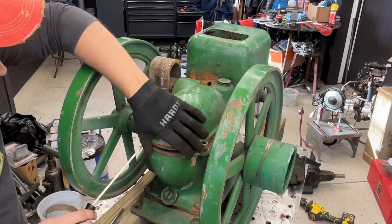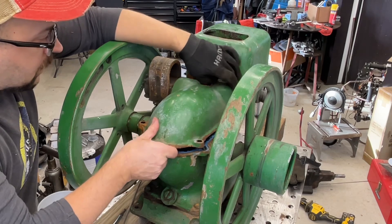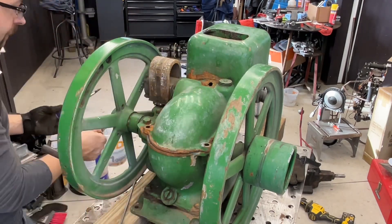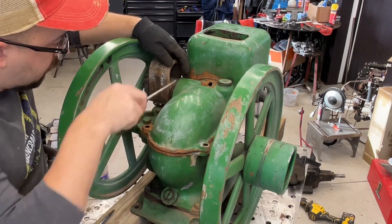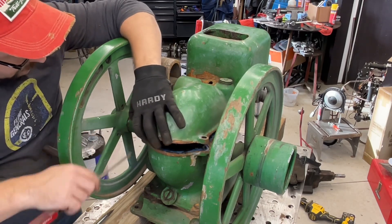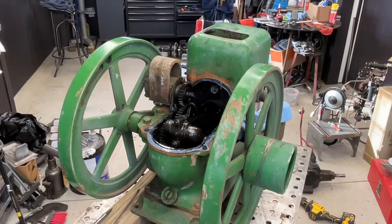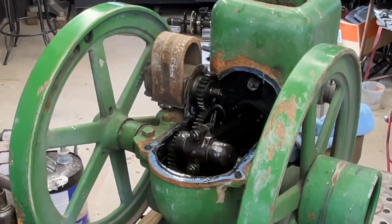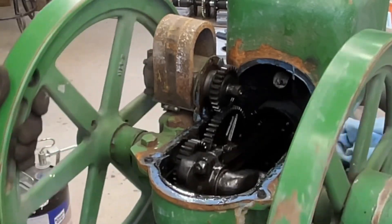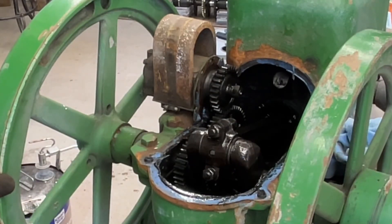This model is nice because it is fully sealed from the elements. Other types of hit and miss engines have an open or exposed crankcase — cool to look at but not practical for outdoor use. With the oil drained, I removed the upper cover. This is a little tricky because of how it attaches to a dust cover for the magneto. The magneto cover needs to have three fasteners removed in order to separate it from the upper cover, which then can come off the engine. Underneath you can see the simple gearing that connects the crank, the cam gear, and the magneto drive. The oil condition is rarely clean — there is a lot of exhaust blow-by on these types of engines and generally it puts a lot of carbon into the crankcase. Later I used some Super Clean to degrease it and remove all the sludge.